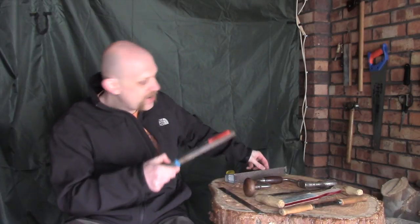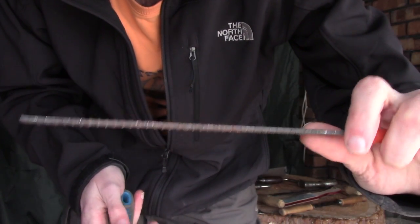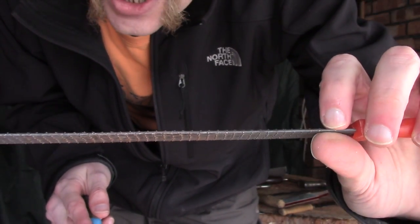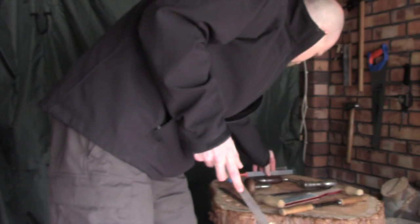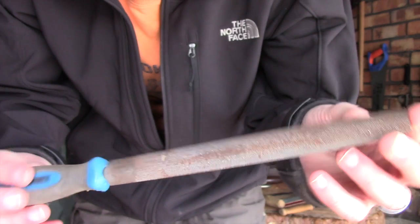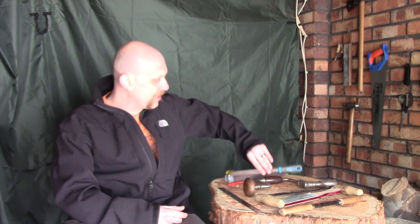Along the same lines, I've got two things here you'll probably be familiar with. This is a rasp - a particularly small one, but a rasp nonetheless. It has a flat side and a rounded side. Again, it's used for the same thing - literally scraping away and shaping the wood. Rasps do leave a lot of tool marks, and I often progress over to a file once I've done most of the heavy work with a rasp or Surform - it just cleans things up a little bit, ready for scraping or sanding.